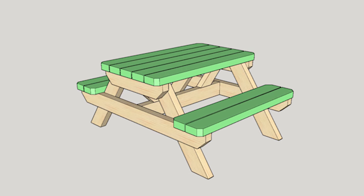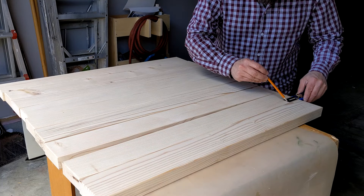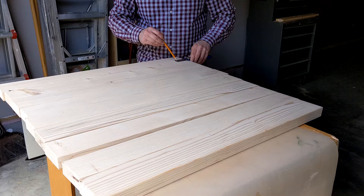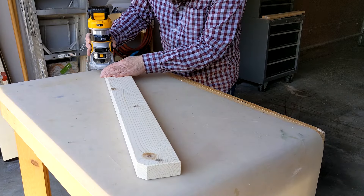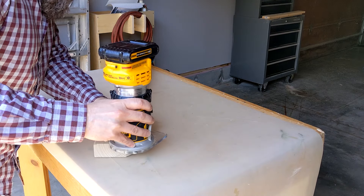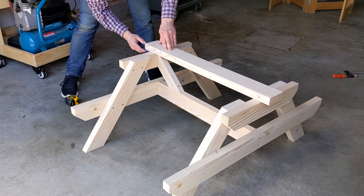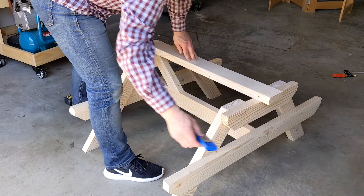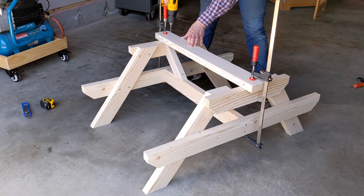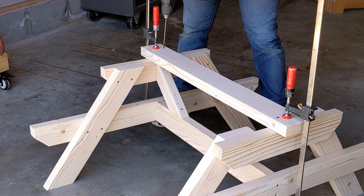The top and seat boards are the same length. Using my miter saw, I cut nine pieces of 2x4 to 31 and 3 quarter inches. Following the diagram, I marked the ends for countersink holes to attach them to the leg assemblies. I used my router and a round-over bit to soften the cut edges. I centered the middle board on the leg assemblies, clamped it in position, drilled a countersink hole at each mark, and attached it to the supports using two and a half inch exterior wood screws. I repeated this step to attach the remaining tabletop boards.